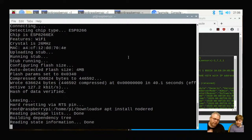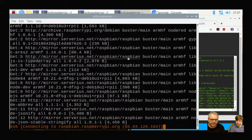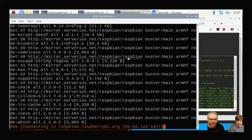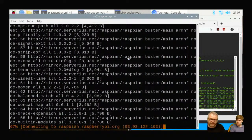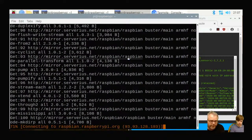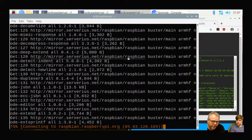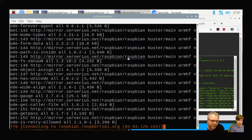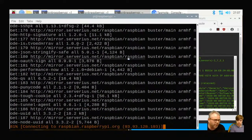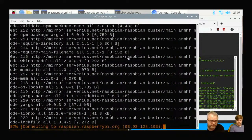Node-RED. So Jeroen is asking why not hook those sensors up directly to the Pi. You can do that, but this is a more generic solution. If you have a Pi and just a few sensors, that's okay. But if you are using sensors over your entire house, you have to put in a lot of cabling. By using the ESP8266, you can place sensors everywhere, even in your garden, even outside, and they will all talk to your broker, which talks to your Raspberry Pi. It could have as well been your virtualization cluster, could even be in the cloud, for all I care.